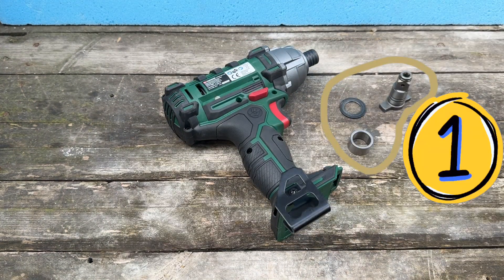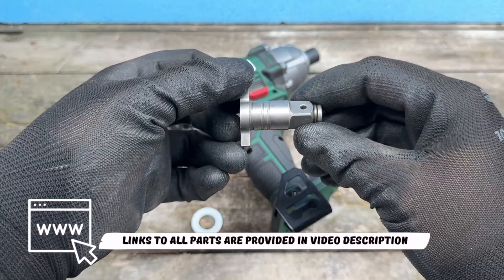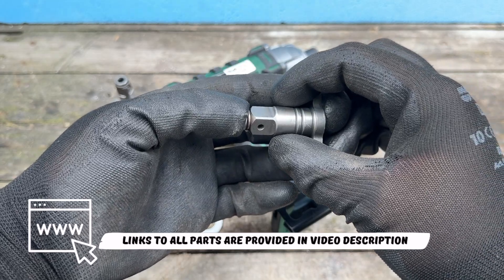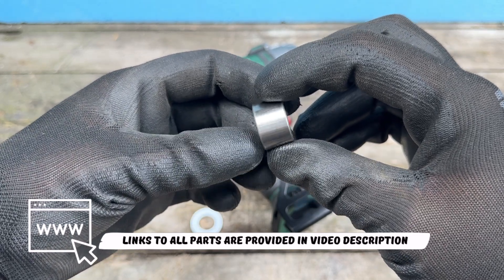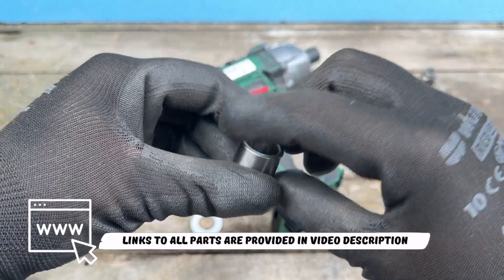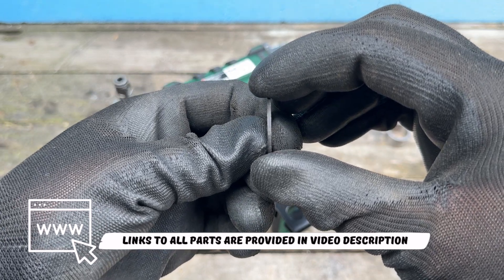Option one: an anvil with an 18-millimeter shaft diameter and a 5-millimeter base. You'll also need a steel metal bushing — 24 millimeters outside diameter, 15 millimeter height, and 18 millimeter inside diameter — plus a washer with an 18 millimeter inside diameter. That's the important bit, and it has a 2-millimeter height.